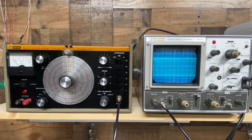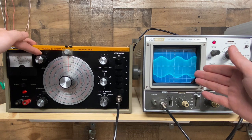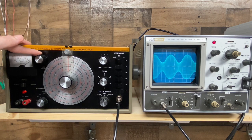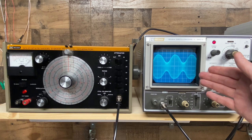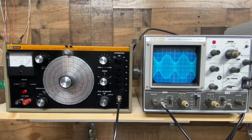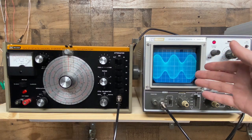I think I figured out the modulation issue. I went back to the audio oscillator adjustment procedure, which calls for adjusting R42 to ensure that the 400 Hz sine wave output is as clean and stable as possible. We saw earlier that the output was very clean, but it was significantly lower than it should be. So I touched up R42 just a bit, increased that output significantly, and let's take a look at the results. As I increase the modulation level, we have significant modulation on the scope, and the meter itself seems to be reading back appropriately now. All the way to the spec — 50% modulation — peaks at about six divisions, troughs at about two divisions. After adjusting R42, it was just a matter of following the rest of the procedure, which includes adjusting R54, the mod level, and the fine attenuator, until the desired waveform is achieved. I think this looks great.